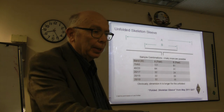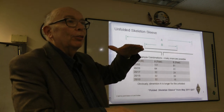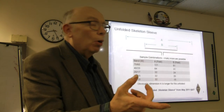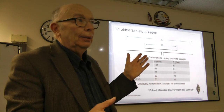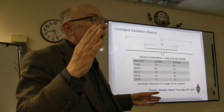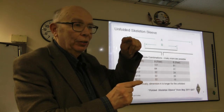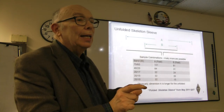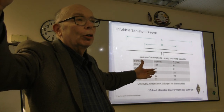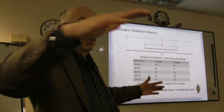Now, you can't do it in all combinations because obviously there's a proportionality. If you were on 80 meters and wanted to really do things right, you'd want what's called ladder line, where you have them 6 inches apart or more. There was a design in QST with an 80-75 meter version. As you know, making an antenna that's flat on 75 and 80 is kind of difficult. But with the two wires, the coupled resonator, you have one for 80 meters for the CW, and then you cut another wire and space it off a few inches for somewhere close to the 75 meter, close to 4 megahertz, and you will end up with almost flat across the whole band.